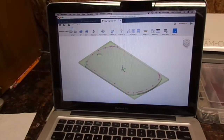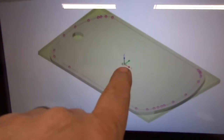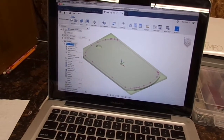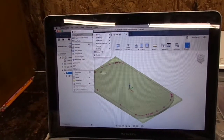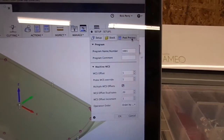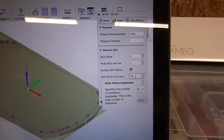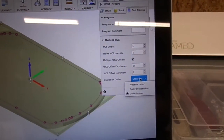I want to show you how I'm going to run the fixtures. If I had an engraving on a tag, this will show you how to get Fusion to make 20 parts. In the setup, go to Edit, and on the post processor — normally this will be at 0 — change this to 1. This one will automatically go to 1. Change this to the number of tags you're going to do, so 20. Then change the operation order to 'order by tool.'